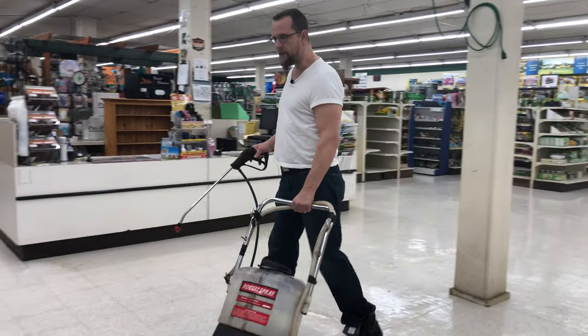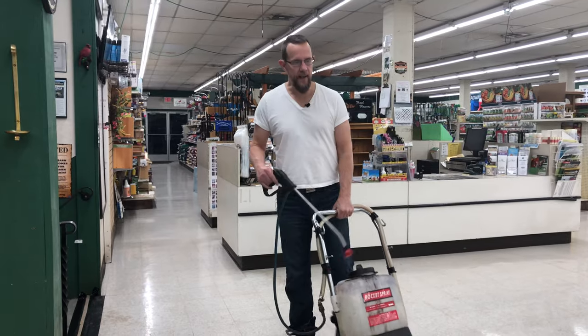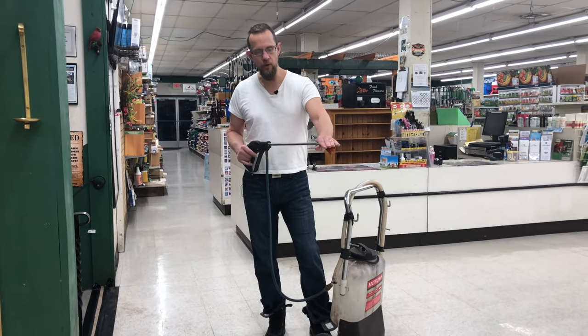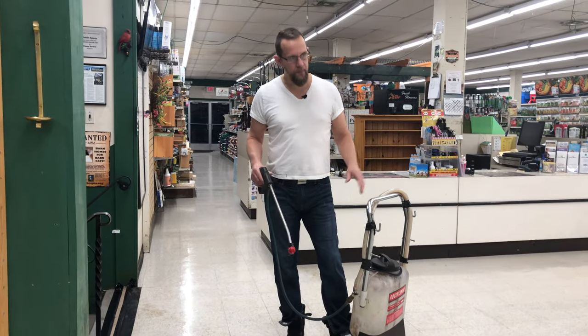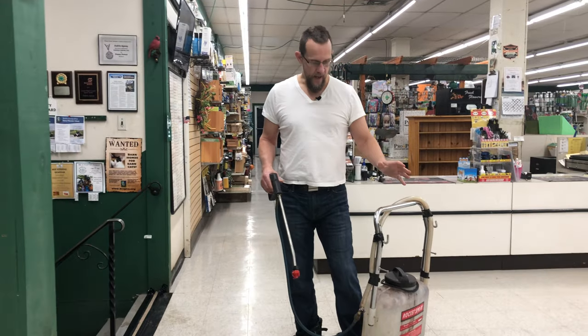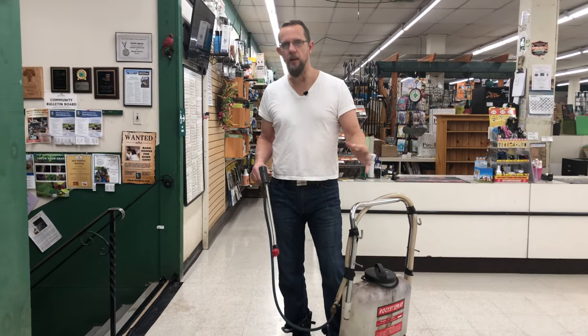Okay, so now we have the floor swept and blown clean, and the floor's prepped nice. We're gonna put down the stripper. Like I said, we're using an ultra low drift tip that's not gonna aerosolize it. On this job, I'm using Diversi Pro Strip at about 25 ounces per gallon. I mix it a little hot.